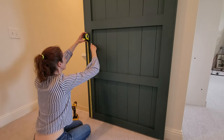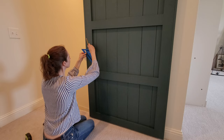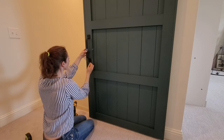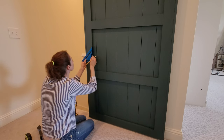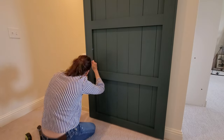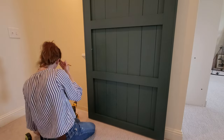Here's a close-up shot of the actuator slowing the door down. Now I'm measuring 36 inches up from the floor for the middle of the door handle — this is a standard height. I also use painter's tape to mark the center of the handle and find the center of the framing. I want to make sure the handle is centered and in the right spot for a comfortable opening.